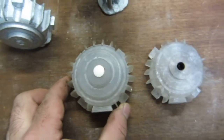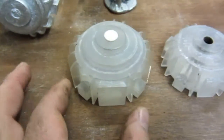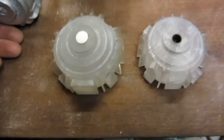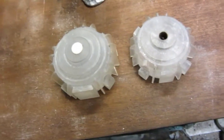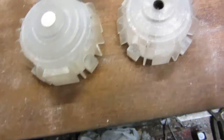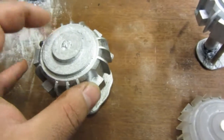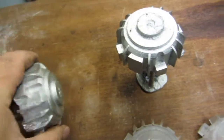But this is the 2015 pattern which I made last year, which I used for some of my machine tool motors, it came out very good. The basic procedure of machining these I show you in some of my other videos is where I put this in the lathe and it's bored all the way through. You know, the inside is hollowed. Not all the way through, but it's hollowed up to about 10 millimeters from the end, because this is where we're going to be fixing our fixing screws. This is where we drill and tap in order to mount the motor onto whatever it's going to be driving.